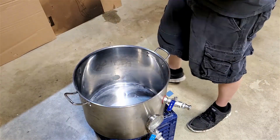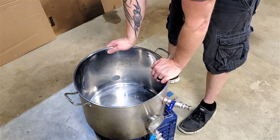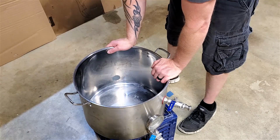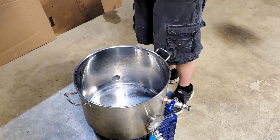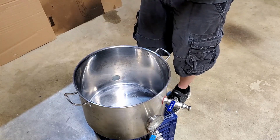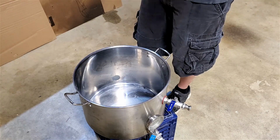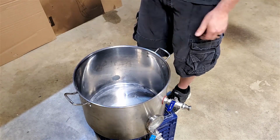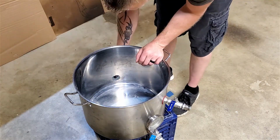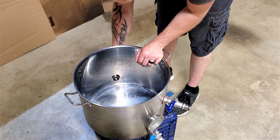Okay, so ran into a small snag. My knockout tool was not the right size. I was going to make a much larger hole than I was wanting. I mean, the goal is to have it as tight as possible around this, so there's as much surface area with this gasket. Ended up doing it dirty and bringing it out with the largest step bit I had and filing the rest out, which I would not advise. It's a mostly round hole. Got a little bit of wiggle room.